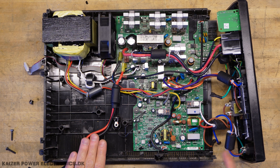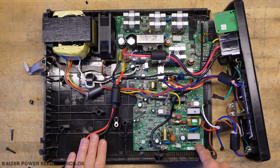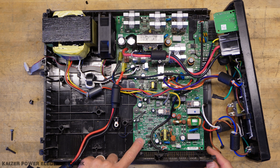Down here we have the input voltage - brown and blue wires go into the corner here. We have some capacitance and inductance common mode filtering, and we have some transient protection. Over here we have the housekeeping power supply and microcontroller. It is marked 2011 version firmware, so this is 13 years old by now.